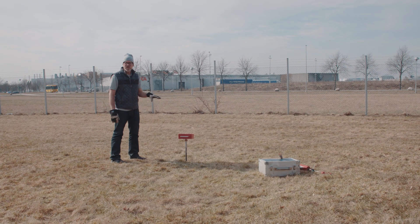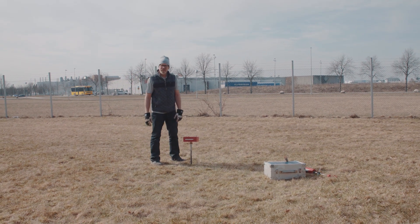When you classify this property it is a high risk area. Even though we have done an investigation of the soil material and found out that it is mostly clay, that means the air volume is not so big, which limits the risk to build on this property because you cannot move the air so easily because of the clay. Anyway, you have to take into consideration that you have radon in the soil. We confirm the value of 95,000 becquerel.